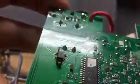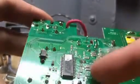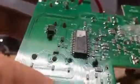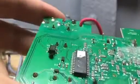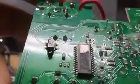So these are jumpers that are allowing them to basically program this thing, then put a bunch of jumpers in and change the topology a little bit. And now I'm seeing why they're doing that. Because this is a single layer board. Normally if you looked at something like this, you'd expect to see two different layers on either side. The jumpers are kind of a way, a very clever way, I might add, of bringing the signal from one side of a trace to another. And you can see actually underneath some of these jumpers, there are multiple traces that go underneath. So this is a way of turning a one-sided board into a two-sided board. It's kind of hacky. I don't know why they didn't just go for the double-layer PCB. But it's kind of cool at the same time.